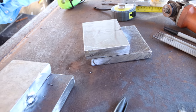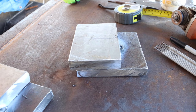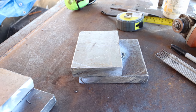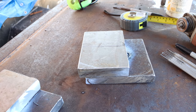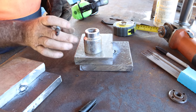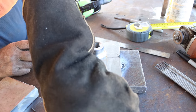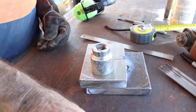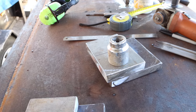These are our plates — the mild steel gets welded to the arms, the stainless gets welded to the boat. We need to drill through so both plates have the same alignment with the bolt holes. It doesn't matter if they're out by a couple of mils from plate to plate, since one's on the left hand side of the boat and one's on the right — it's mainly about the two plates aligning and being bang on. We're getting a socket that's going to be more than big enough for the head of the bolt, and we know we'll have clearance, so we just need to space the bolts apart far enough.